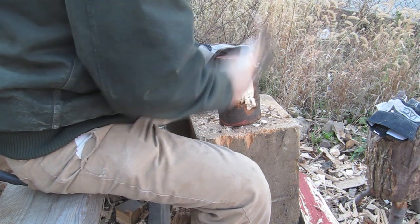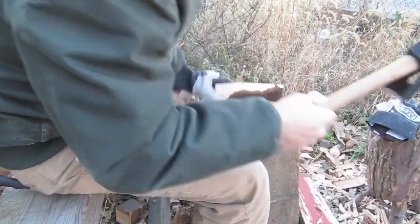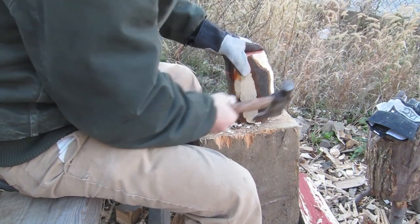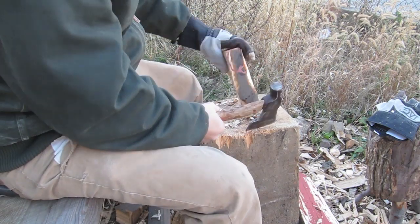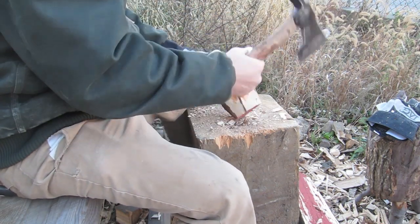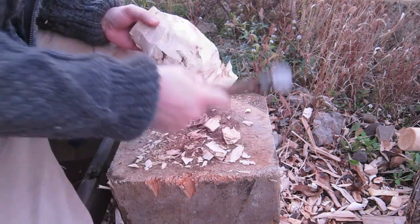This is another area where you don't want the inside of the bowl to necessarily go as deep as you think it will be in the end — you want a safety area, and you'll go back in with hand tools to make those final few millimeters of adjustment with much more control over the thickness and shape of the bottom. Keep feeling it throughout to make sure it's the right thickness and you're not getting too thin. Part of carving with the hatchet while holding the wood with your hand is being able to transfer the force of the swing into the wood instead of the wood bouncing all over the place.